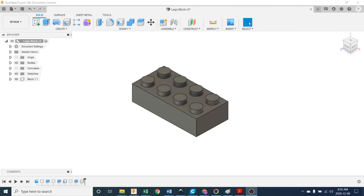Interestingly enough, Lego spends a lot of time precisely making their blocks so that they stick together pretty easily but don't just fall apart. They actually use the elasticity of the plastic and what's called an interference fit, where one piece is slightly smaller than the other. And then when you stick them together, the plastic stretches a little bit. And then when you pull them apart with just the right amount of force, they can still come apart. They should easily come apart by a small child.